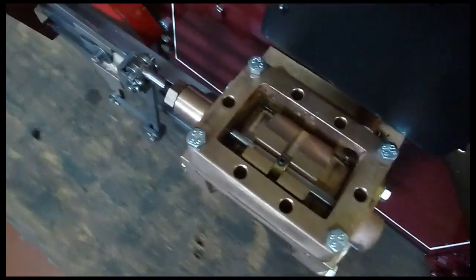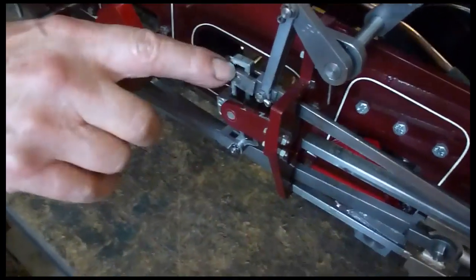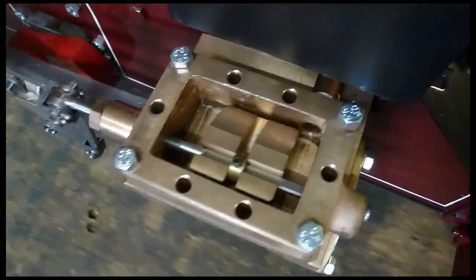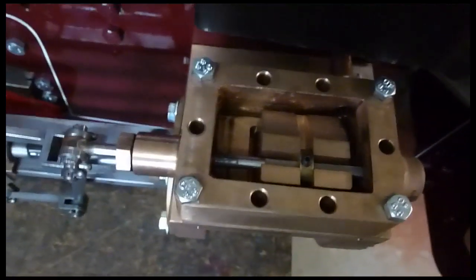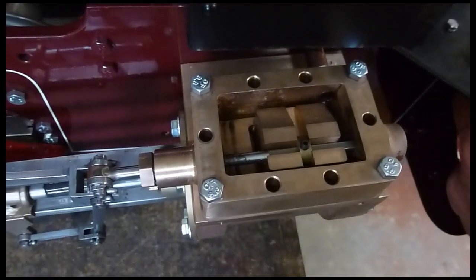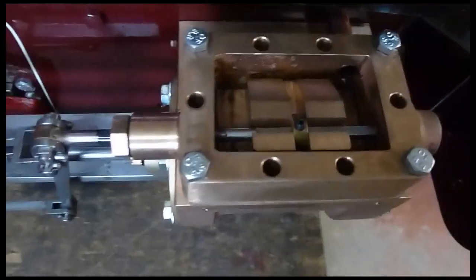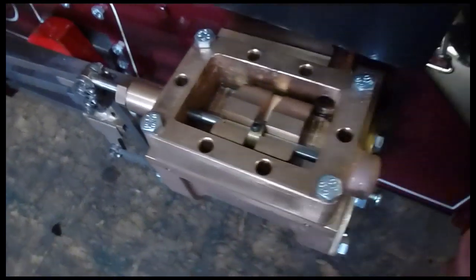This engine's still quite tight because she's so new. Then you go into forward gear — which is near but not quite to the top of the link, because you need to allow a little bit of clearance. You should see the valves open: when it goes into forward, you should see the ports fully open at one end and then fully at the other end. That gives you the basic valve setting, and you can mark where the notch goes in the reversing lever for that forward position.